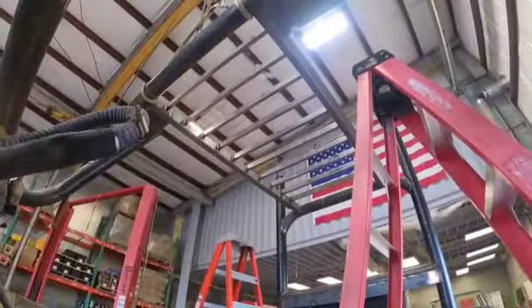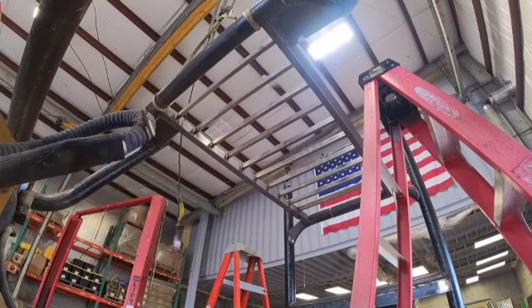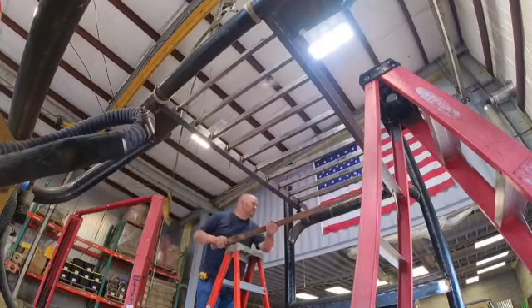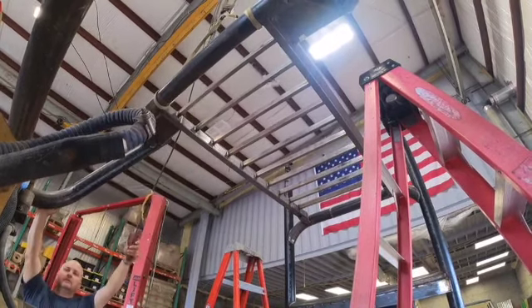Pretty much we have finished up the bar we welded in. So what you're seeing here is us taking off the top of the roll cage because we did not build the back mounts correctly. So we have to take them off, grind them off, clean them up, pound the metal flat because it's going to be bumping stuff, and then we have to put it back up, weld in the new plates that we have.